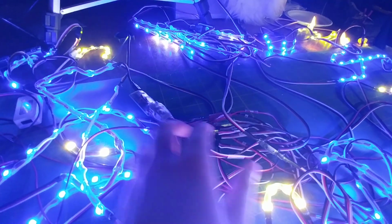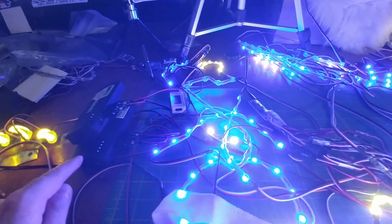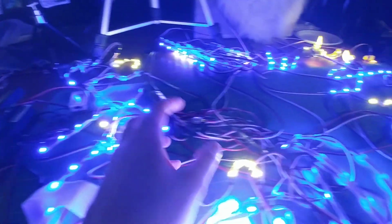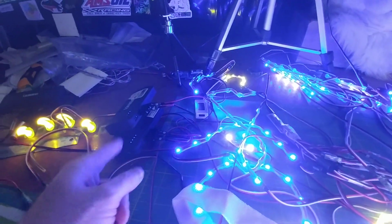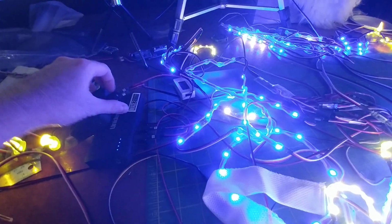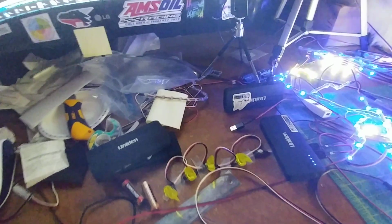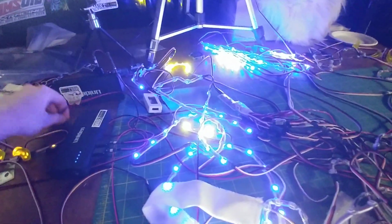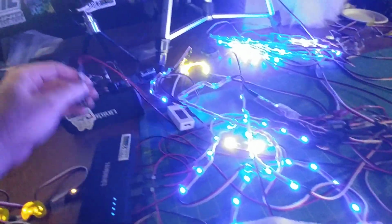The power's all routed, and the power is not shared between the power banks, if you know what I mean. They're not all just bound up into one and spread out, because I had a worry that the frequency of these things might clash with each other because they're switching power supplies. So more testing is required, but I just split it up. If I unplug number 2 right now, and suddenly half the suit is dead. So if that power bank dies, then yeah, okay.